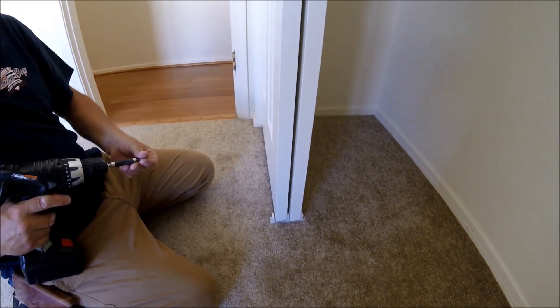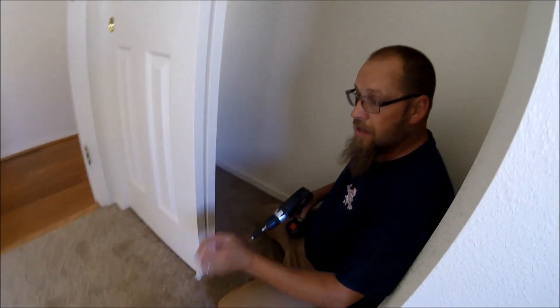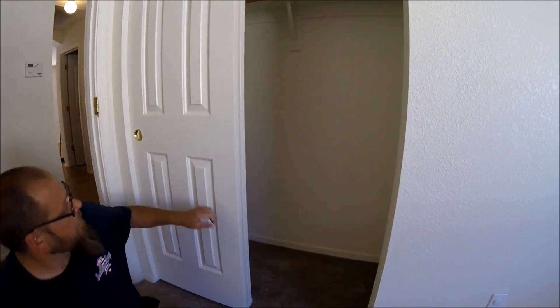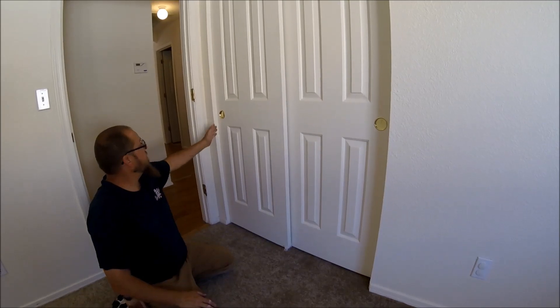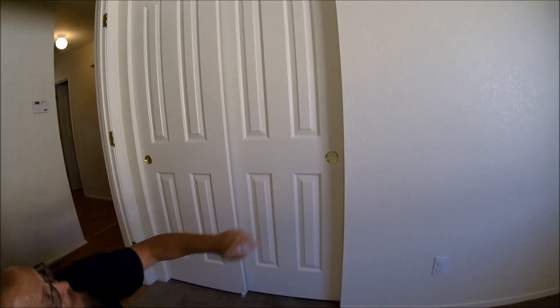You don't really have to worry about damaging your carpet unless you have a Berber carpet. If you have Berber carpet you're definitely going to want to put these screws in by hand, not with a drill. What will happen with a drill is these screws can catch a thread and run out across the room, because Berber is made like a sweater — if you snag it it'll just keep running. So I would definitely use a hand screwdriver on Berber carpet. There we go — we got them both in. These doors look pretty straight. This side is straight, and on the other side it's not so straight, but that's okay because that's the open position.